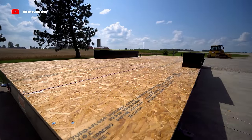And then I placed a good thick bead of silicone along the front edge of that door pan as well. I also used some PL construction adhesive and put a generous amount along the back side of that door pan. Then we can lift the door into place.